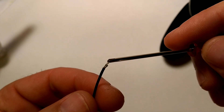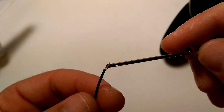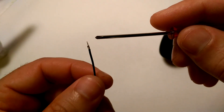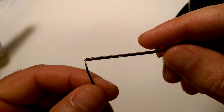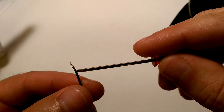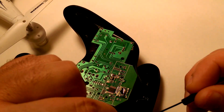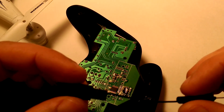Put a little bit of soldering flux on it — it really helps the solder stick. Just give it a little dab so you have a nice flowed solder tab there. Now we want to strip the wire. There's a center conductor, then some clear insulation, and then the actual ground shielding around that insulation. The length of the wire doesn't really matter — what matters is the length above the decoupler. Snip just enough to be able to stick onto the solder pad, and cut a little bit of the black sheeting off. Before you solder the 2.4GHz antenna on, make sure you put it through the proper sheathing before doing the soldering.